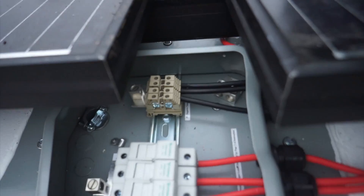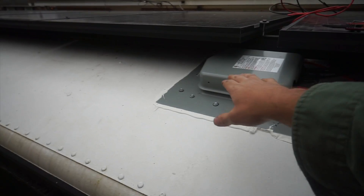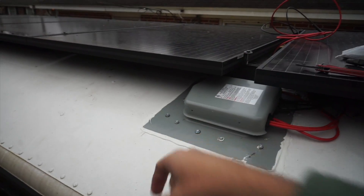We're all wired up now. No fuses in there yet, so everything's still open. I should be able to run some 8-gauge wire from here to my solar charge controller, put my fuses in, and see if I did everything right.